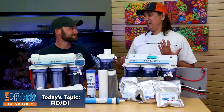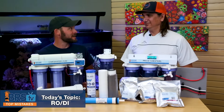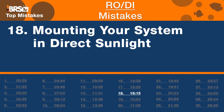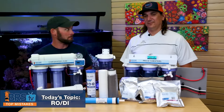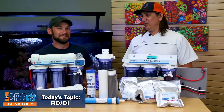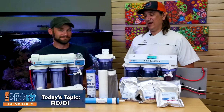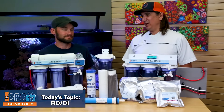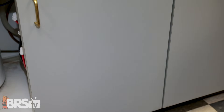Number 18 — not very common in Minnesota, but it is in warmer climates. The mistake is letting your RO system hit direct sunlight. If there's nitrogen, ammonia, or phosphorus in your water and you add sunlight, you will grow algae in your system — it becomes an automatic algae farm. This applies to any light source, not just sunlight. Make sure to install your system in a dark area to get the best performance.